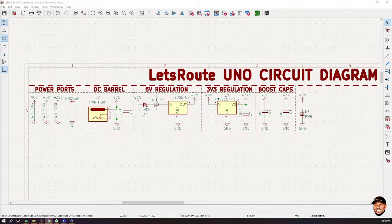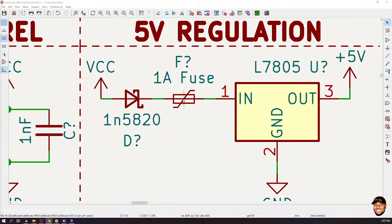Okay, so this polyfuse's main purpose here is to prevent short circuit, to regulate short circuit current. The system is not even getting to 800. And if it does, yes, I want the polyfuse to trip. It's just that. But one thing I find confusing from your side, and I want you to understand it: when you are designing a circuit, it is not about you saw somebody doing something. You don't know why the person did it. You should always design based on your requirement. If for this system I needed to trip the polyfuse at 300 milliamps, that is what I have to put there. It's not about you saw this and I saw that. What is your circuit demanding? That is how you design your stuff. That is the understanding I need you to get.